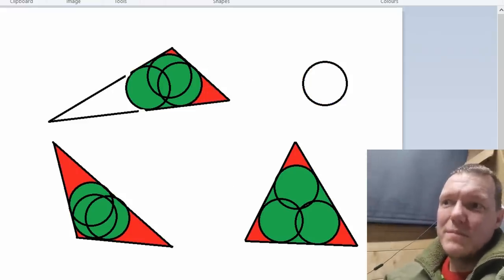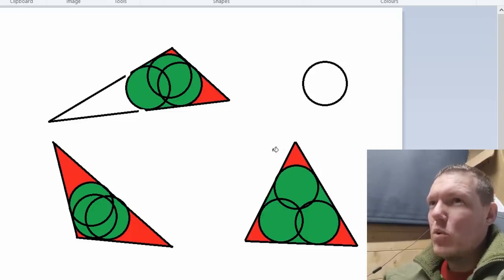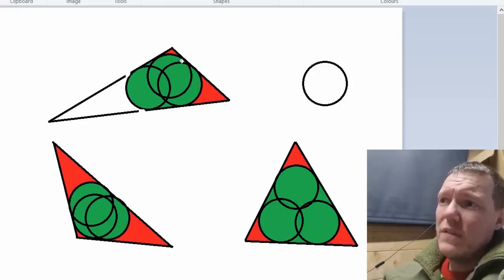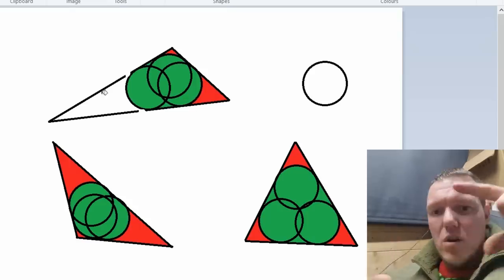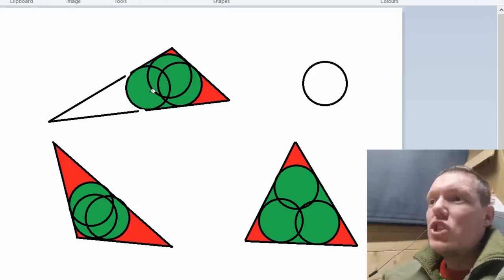This is why an equilateral triangle, so they're equal, they're about the same, where these ones, if it's near 90, you're going to get a little small edge taken out, and if you're really tight, you're going to take most of it out. So this nice, long, thin shape you think you've got, you're going to end up with this. So you have to change the sizes.